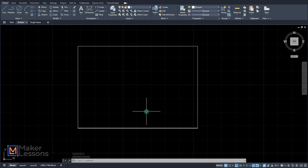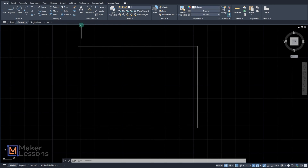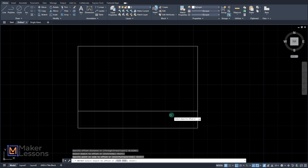I'll start by actually offsetting the front face. Down here we have a little step, and that step is 5/8 off from the base. So offset — 5/8 is 0.625, look at that, already in there. Click up — 0.625 offset from there.